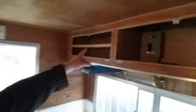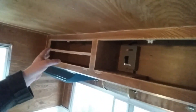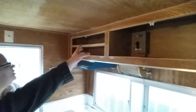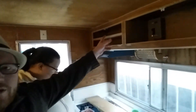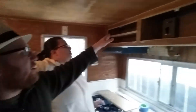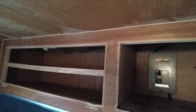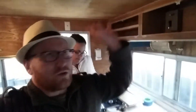Everything seems to be okay — kinda. Up there, there was once a leak in the ceiling. I fixed it. It's now dry; it has been dry all winter. We know that problem is fixed. To fix the cosmetic side, I'm just going to take the shelf out, put a piece of plywood in there, and push against the back. That'll lift that little piece of wood up and just cosmetically fix it. What we've done so far is structural to the roof — it's all secure in this area, so it's all cosmetic here.